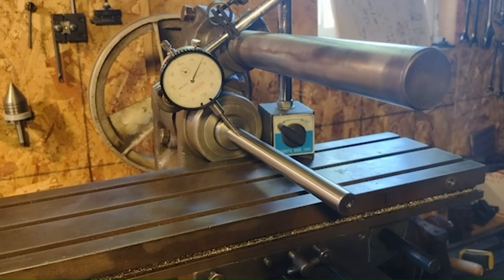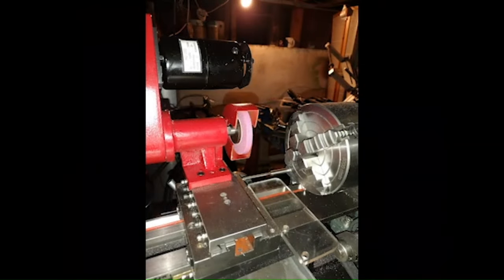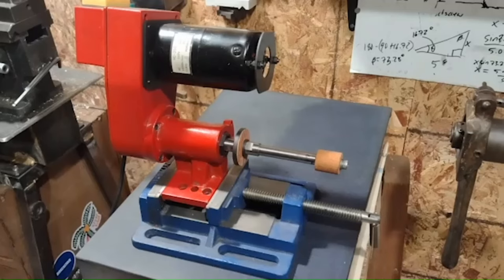I think what I may try doing is reaming this out on the machine itself. After giving it some more thought, an idea began to form — one that would use this weird tool post grinder and a sine bar. I then whipped up an arbor, because we're going to do some internal grinding, but this one ended up having some issues. I'll allow my former self to explain.